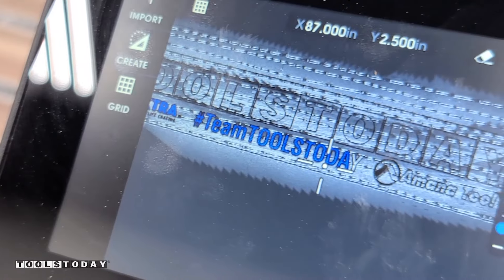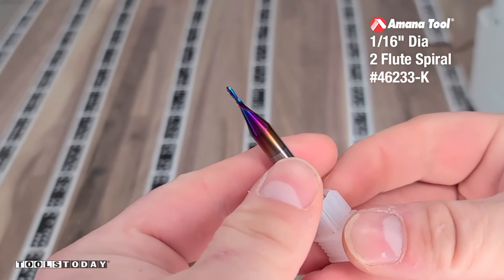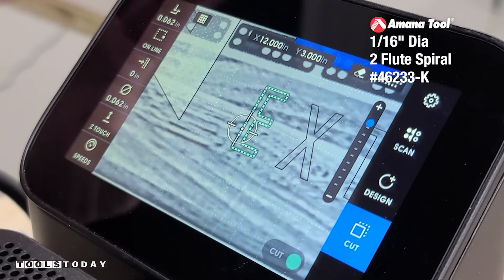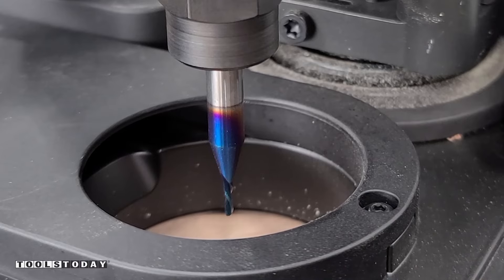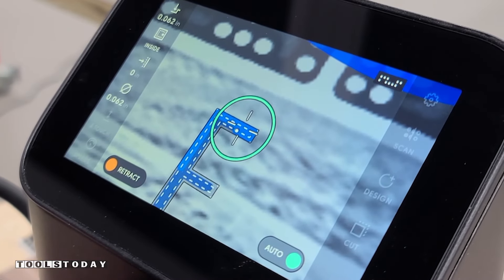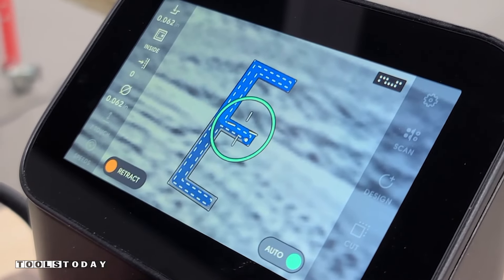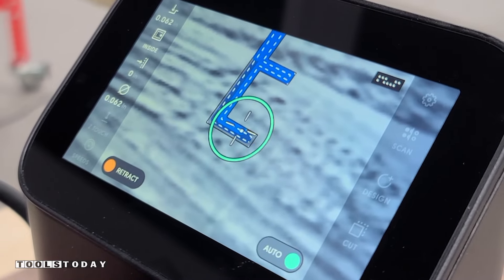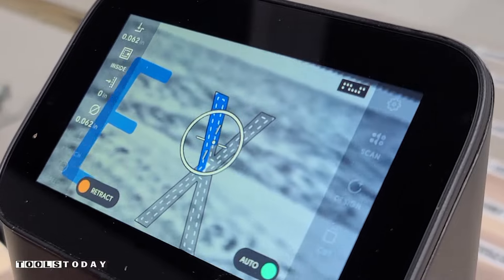The first thing we're going to do is use a 1/16th inch bit — this is the 46233-K 1/16th inch down-cut bit. We'll go ahead and set up our tool paths. I'm using a profile cut here and we're going to carve into this. This is a really small bit, and one of the more asked questions we get about the Shaper is how fine a detail it can get. Essentially it can get as fine a detail as you have a bit for — you can even use engraving bits to get really fine detail — but these are really pretty small letters.